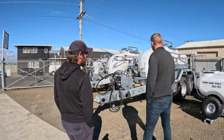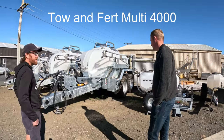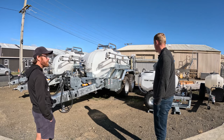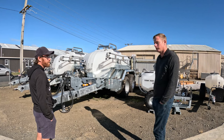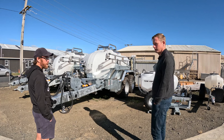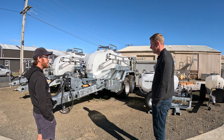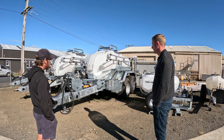We'll start with the big one. That's about 4,000. Holds 4,000 litres, but we can get up to do a lot more than that in tonnage. So 4,000, we've got 4 tonne of lime flour with 2 tonne of water. And we'll suspend that. Quite a high ratio. Obviously puts about 6 tonne in the tank. Need a bit of cooling power for it.